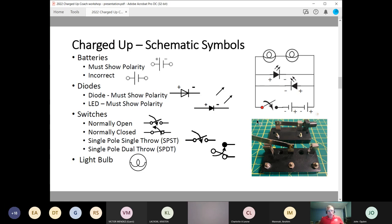A normally open switch is your typical light switch on your wall. It's open until you close it, and that arrow shows that when you flip the switch, it goes down and makes connection. The normally closed switch is the opposite — it's normally closed, and when you flip it, you open the switch. Next, we have a single pole, single throw switch — the most common type of switch used.